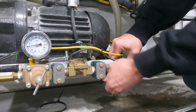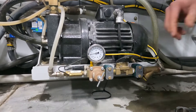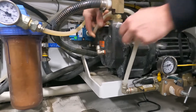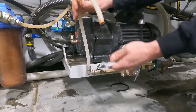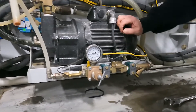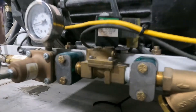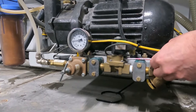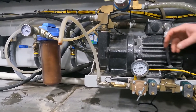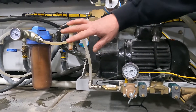The second thing we'll want to do is check our water flow on the exiting side and see if we're actually getting restrictions. We come to the left side here and disconnect off of the pump, then put this into a bucket to measure our water flow. On the on/off valve, you don't want to just turn your vacuum pump on to make the water flow because we do not want to run the pump dry. On the on/off valve right here is a recessed flat-headed screw — take a flat head screwdriver and turn that 90 degrees and that will turn our water on. We want to make sure we're getting at least 1.4 gallons a minute, which will give you your optimal vacuum.